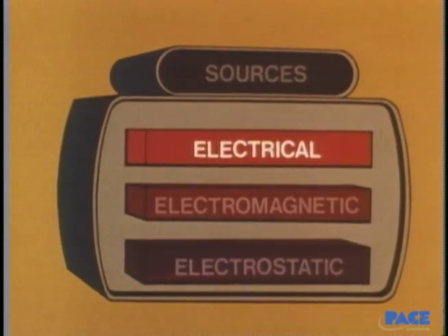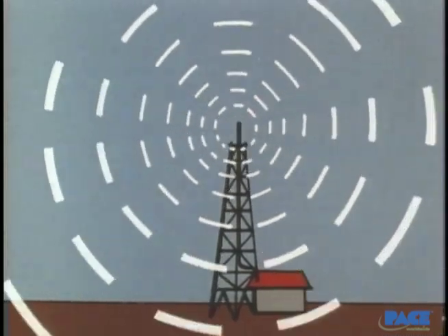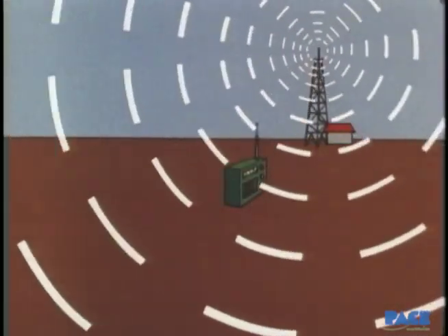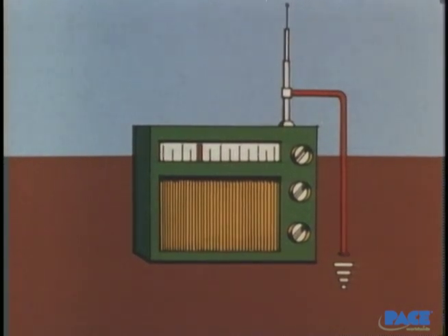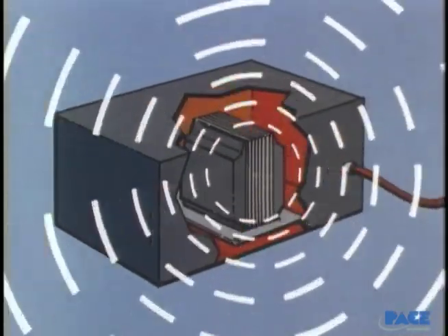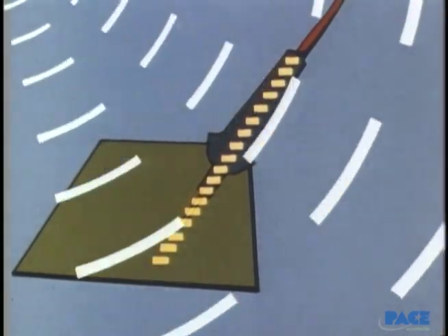Another form of energy that may cause damage is electromagnetic. It's a field of energy that travels through space and makes radio transmission possible. The closer the receiving antenna gets to the transmitter, the more energy will be induced in it. An important characteristic of this type of field is that it's a ground-referenced one. And because of this, if you ground the receiving antenna, no energy will be induced. In our work, we have a similar situation. A transformer in the equipment may be acting like the transmitter, with a fluctuating magnetic field around it sending out energy. A soldering or desoldering tool can act like a receiving antenna, picking up the energy and carrying it right on into the work. The way to prevent this is simply to ground the tool. Then no unwanted energy will be induced into the system.